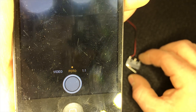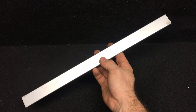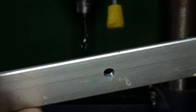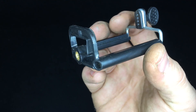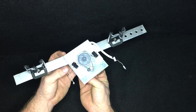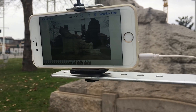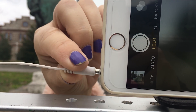As you can see, it can move very, very slowly, clicking the switch above. When we press the switch, we can take pictures with the smartphone. I also take from the selfie stick the base where I can mount the smartphones. An aluminum base is used to connect both components, one on the left and one on the right. I make eight-millimeter holes — about ten of them — so I can decide the distance of the smartphones later. I found that a good distance is about eight centimeters, and the electronic part with the motor goes here in the middle. The jack cables from the selfie sticks go inside each smartphone.